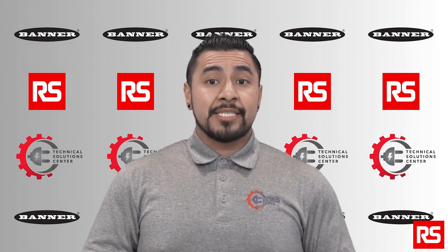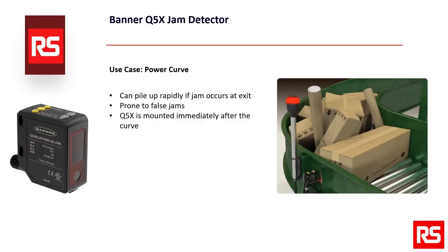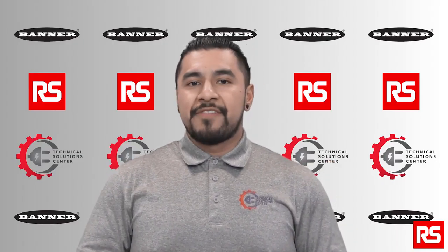So what are some use cases for the Q5X? One is the power curve. This happens when packages are entering a power curve and they can pile up rapidly if a jam occurs at the exit. This area is also prone to false jams as the bulk flow of packages offers few gaps for traditional methods to detect the jam. In this application, the Q5X Jam Detector Sensor is mounted immediately after the curve, allowing it to detect real jams quickly and minimize false jams.